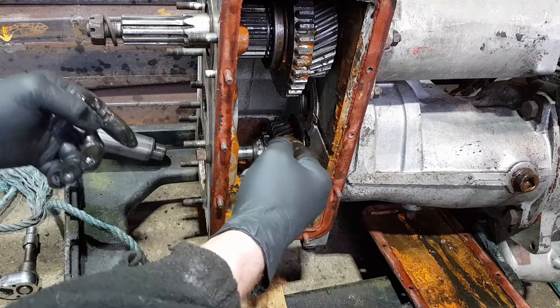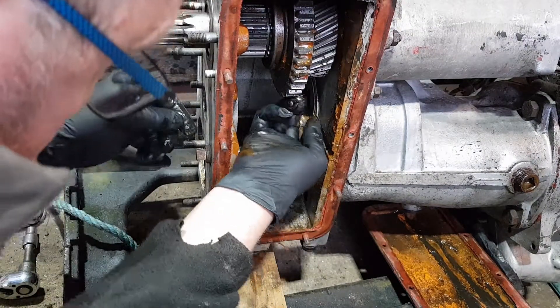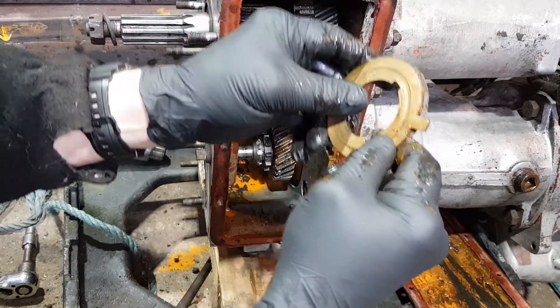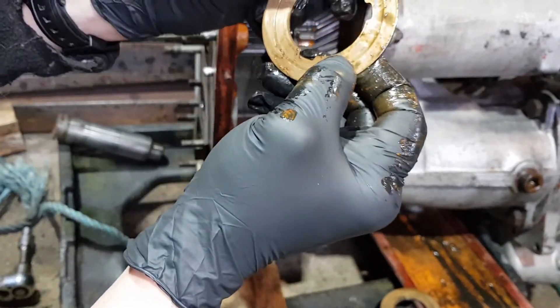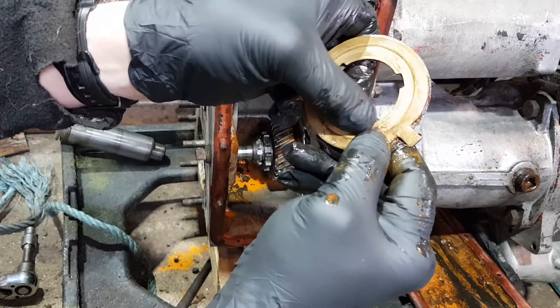Now, each end of that, to secure it from wobble, is a thrust washer that's shimmed — must keep these together. And the same weight round, I've found that's come out without a shim, so that side didn't have a shim fitted. A little bit of wear on that, otherwise good. No wear on the inner one.